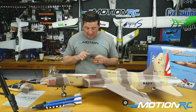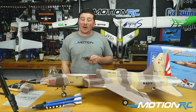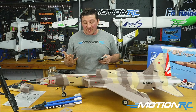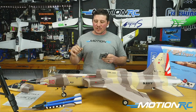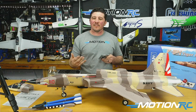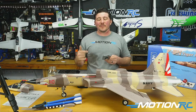Here we go. Is the R knob auto set to adjust gain? Yes, the R knob will be auto set to adjust the gain. I didn't plug anything in differently than I did. I did nothing. It's automatically in there. So I guess if you went manually into the right knob and just inhibited the knob, you would turn that off, but a remote master gain is great to have on a gyro, and it's something I don't think you'd want to turn off, but you've got to be conscious of.